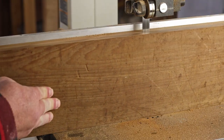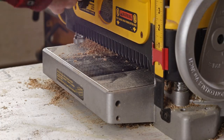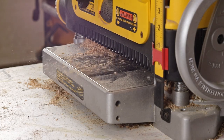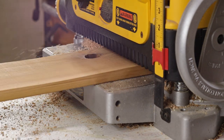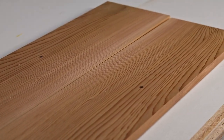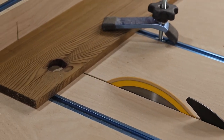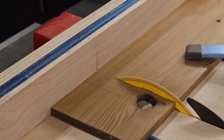The cut down the middle is never quite perfect — the blade does tend to drift a little here and there. And even cut in half, these are still too thick for my design, so they go into the planer. I need to get them down to a half inch to make the tray. After several passes through the planer, I have the boards down to my half-inch requirement. There was a knot in the end of the board, so I'm going to use the cross-cut sled to trim that away first.